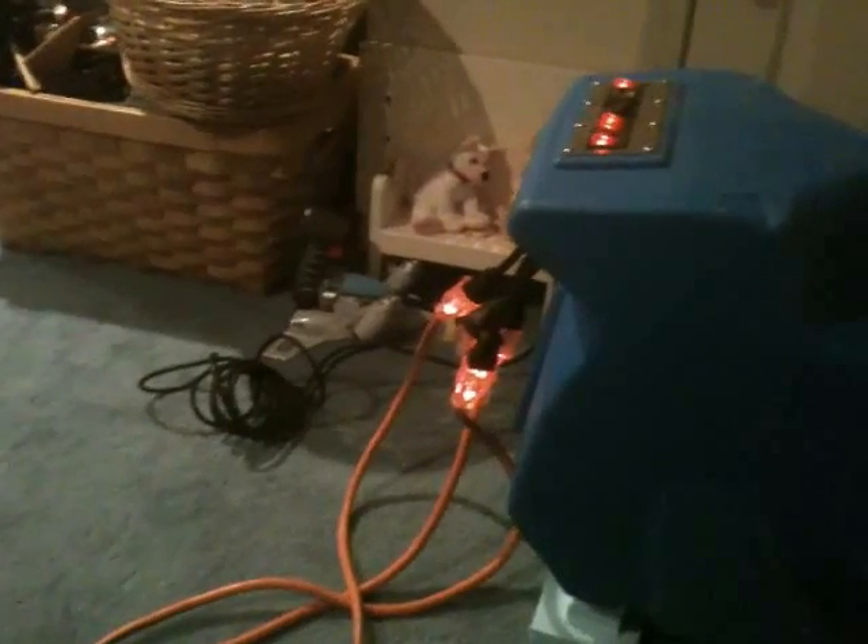This is the output of the ELE, coming out at about 140 degrees. We've tipped the back of the machine up in the air — this is something we commonly do. We've put blocks underneath the back and tipped the machine up so the hot air blows down and across the carpet in this contained area. It sweeps across the carpet, pulls the moisture out, then goes up into the room. We try to focus the heat on the wet area, and we use fewer air movers doing it this way, giving more power to the machine. This should be dry in two or three days, and we'll pull the equipment out after checking with all our meters.